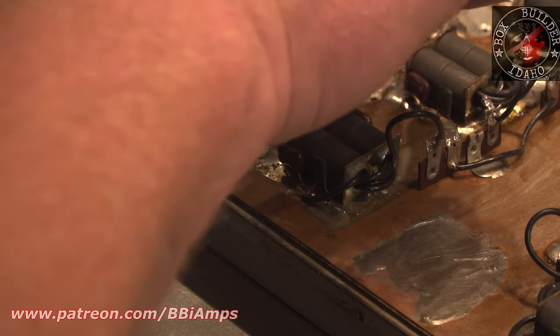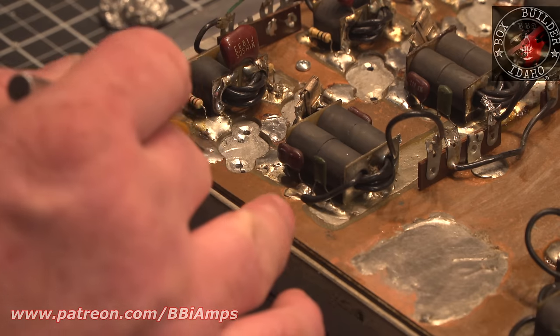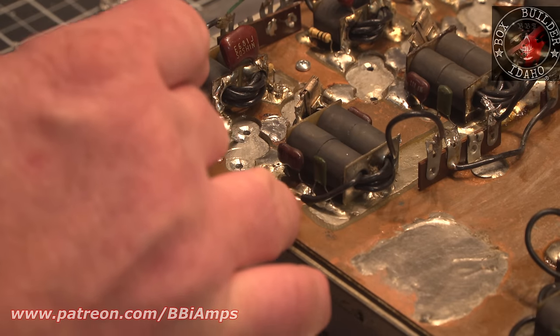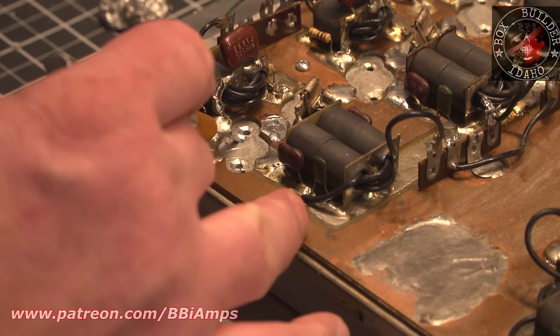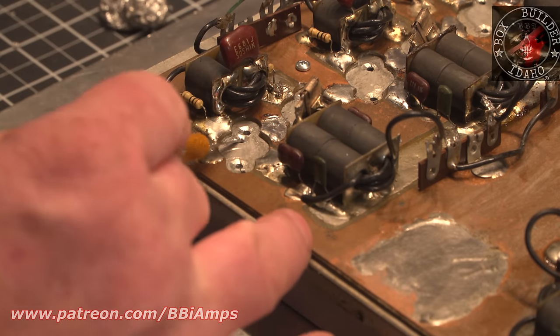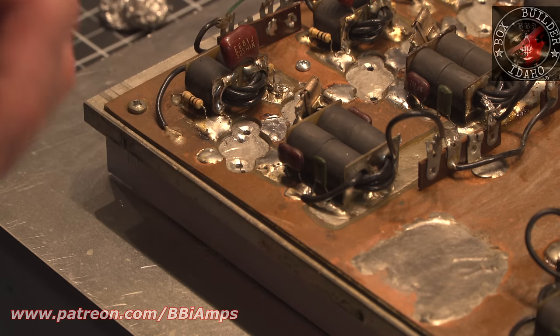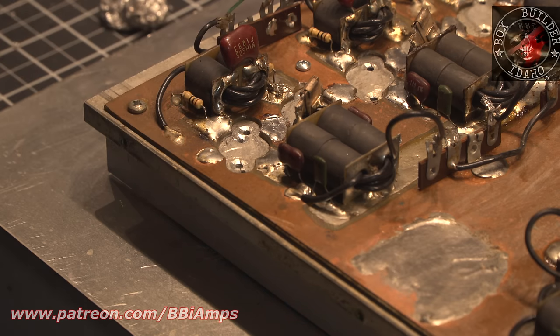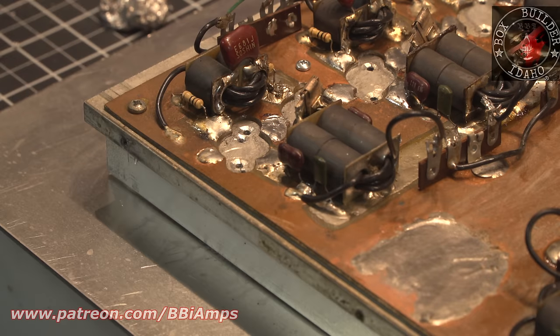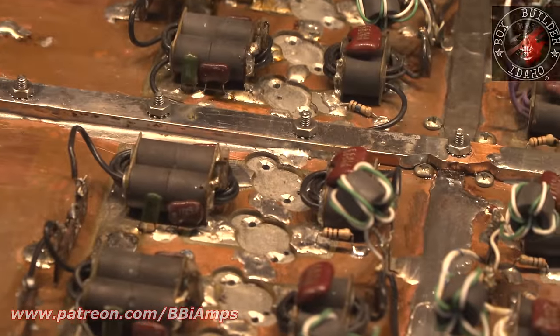There's an extra screw hole, like a 1/16th of an inch offset. The problem is this hole here had such a lip on it. There's that raised elevated lip. I had to countersink this as well. So now we're getting to the point where we're compromising the amount of heat sink underneath the foot of the transistor. We reach a point where this is just becoming silly. Now let's go talk about this section.